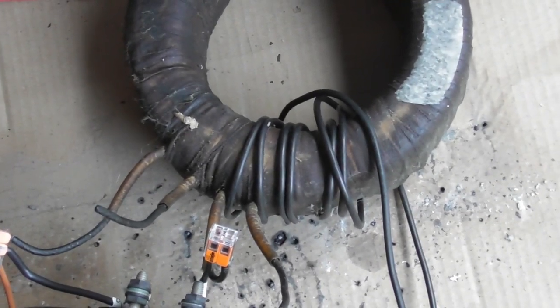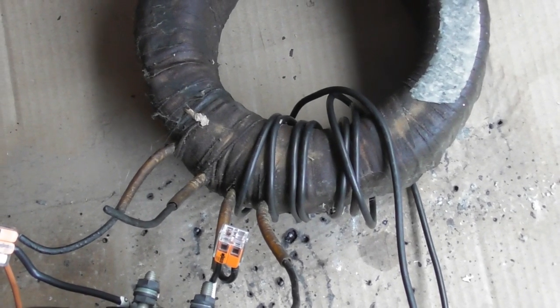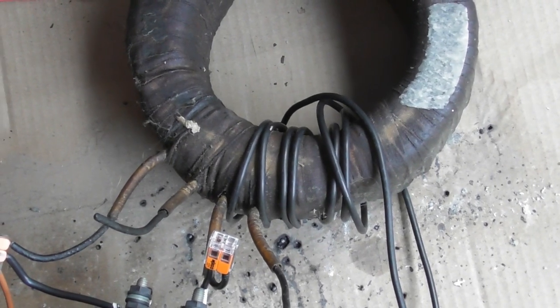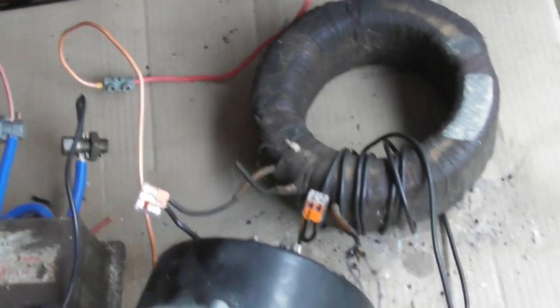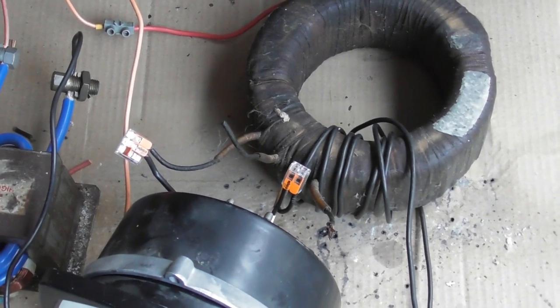Okay, to add on, like old current transformers, same as voltage transformers, by adding or removing turns you can increase or decrease the current output, or voltage output on a voltage transformer. So yeah, you can modify ratios, whatever you have your hands on.